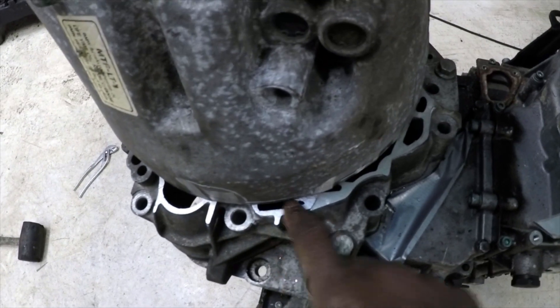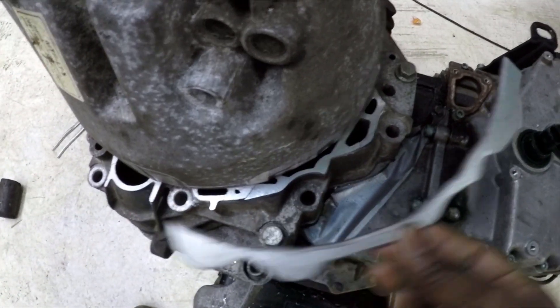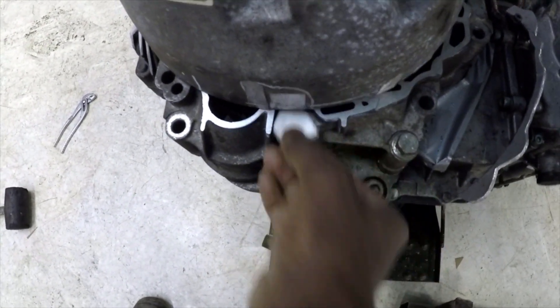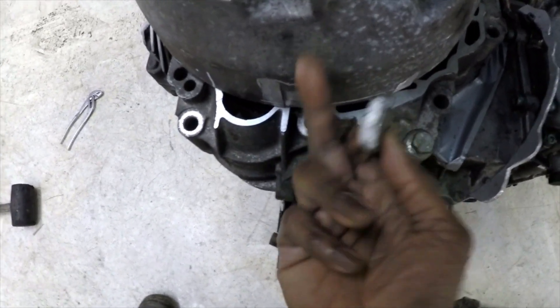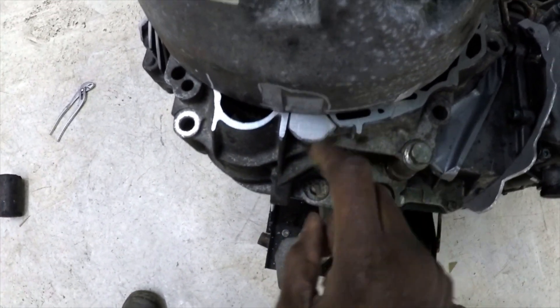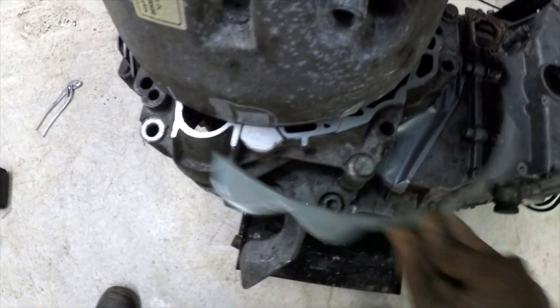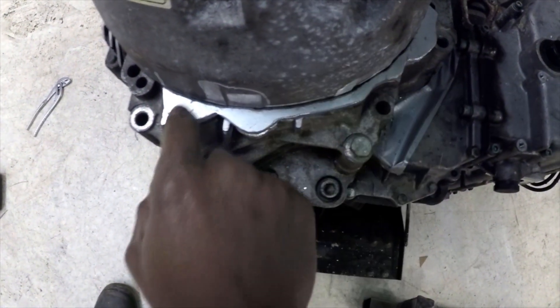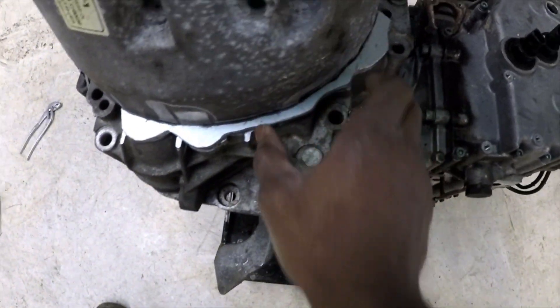Without taking too much strength away from it, I've got all these holes to fill. What I've done is made this little plate and a couple of little bits just to go in. I'll weld this over the top and drill from the backside back through to give me a decent place to bolt from. That one will go on there, and this one will just sit like so. I've started to groove it out just so I've got some space to get in and weld.